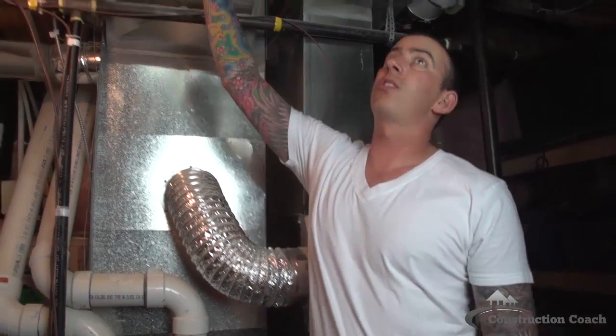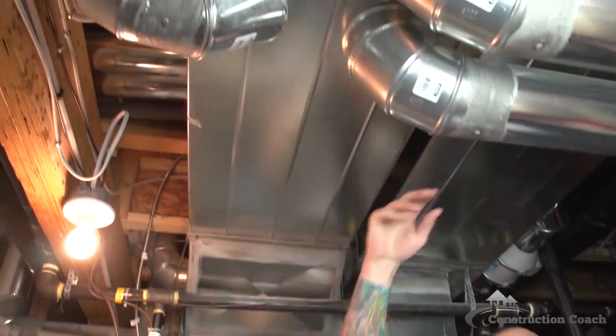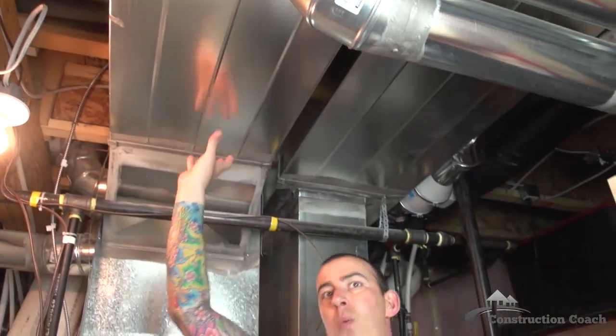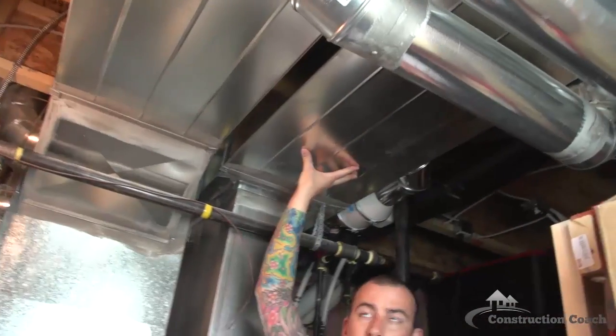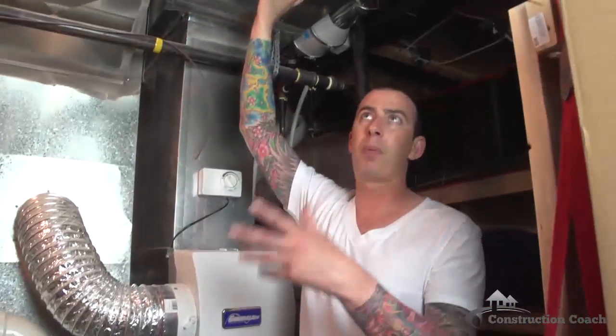When you're doing a bedroom in a basement or any separate room other than a washroom in a home, you need to have a cold air return which recycles the air back to the furnace from each individual room, reheats it and sends it back out. This duct here is our heat run duct — it's got many elbows coming out of it going to various rooms throughout the house. From this heat duct, we need to have a run in each of the separate bedrooms out in the basement development. This duct work here is the cold air return duct. It returns air to the furnace which then gets recycled and heated up and re-sent out.